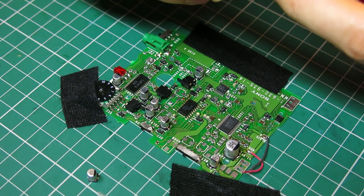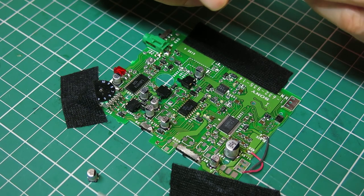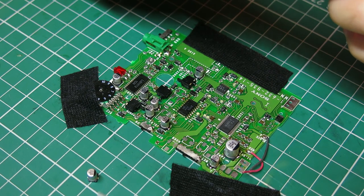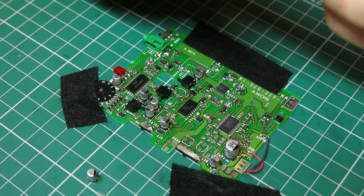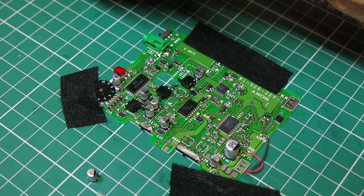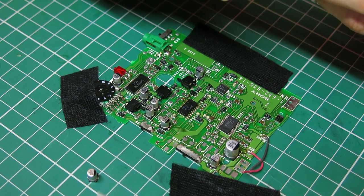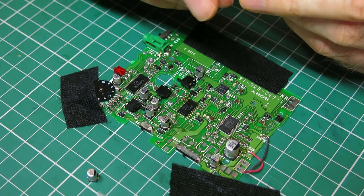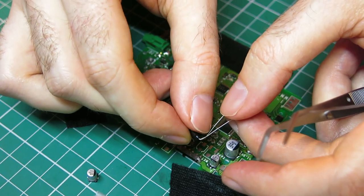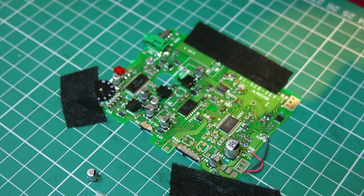as close as I can get that starter to the body as possible. It's a fine balance between starting the bend off in a sensible place and not having too much access, but also not pulling on the rubber seal. But for the clearance, you have to get pretty close to the body like that, where there's a very definite bend in the wire, but it's not pulling directly out of the back of the rubber seal. And then I'm going to try and bend it again back on itself,